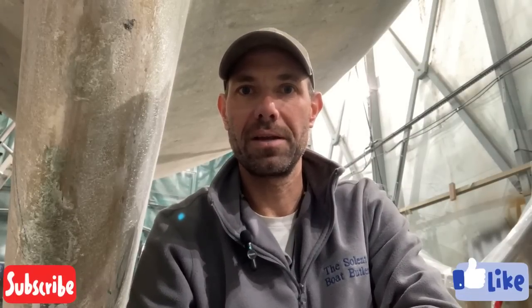This video has largely been about drying out the hull laminate. So just to recap, after she was peeled, I had her media blasted. I then washed the hull down with a pressure washer many times. And that actually helped with the weather that I had at the time, which was kind of dry and warm, to remove some of the moisture and some of the salt content out of the laminate, which was really good. But there's only so far you can go with that in a short period of time, unless you want to leave your boat outside for months and months and months in some warm weather. So I then used my heat and vacuum system to remove the moisture content and the other chemicals that are in the laminate to get it fully dry.